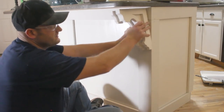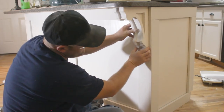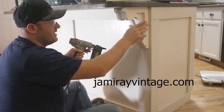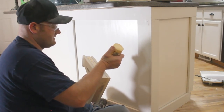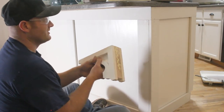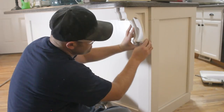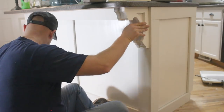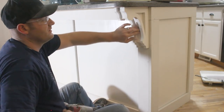I've made some corbels that Jamie wants to fit under here. They're not structural — they could be, they're plenty sturdy — but these are the lins, they're on our website at jamierayvintage.com if you love them and you want a pair. I've just got some wood glue, and because I'm just stapling these on, the glue will help hold it on there pretty well once it's dry. I'm just lining that up with this seam right here on the edge, and I'm going to toenail these in — that means going in at an angle instead of going in straight.